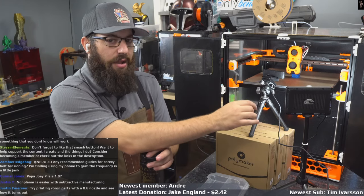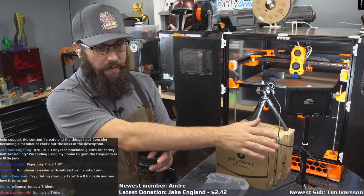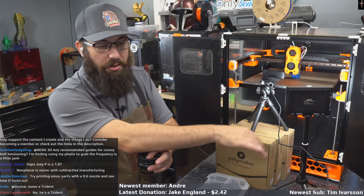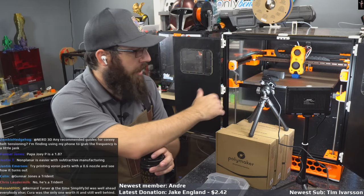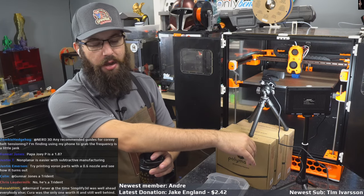Is that as accurate as pushing the right amount of filament through the right size hole based on a tool path? Hard to say. I've only tried the Arachne engine a few times, and I used it in Super Slicer, and it's broken. I didn't like it because it under extruded all hell and back. So, yeah. But let's be honest, most people could probably print with a 0.8 nozzle and they'll never realize.